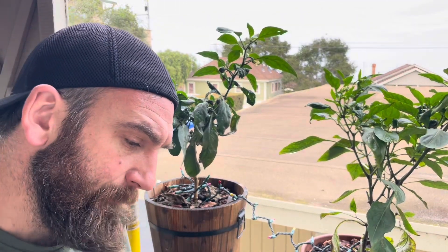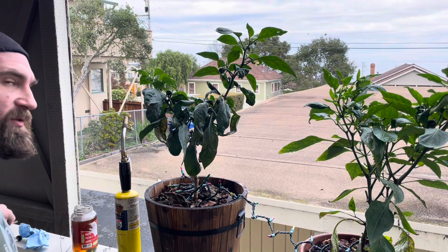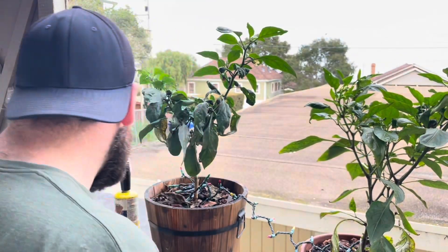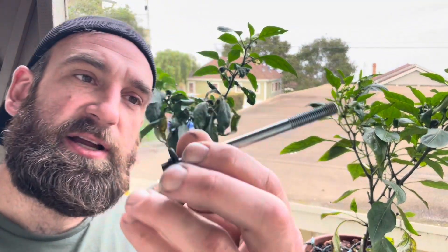Here's a little life hack. Some of these bolts for the center section to the pedestal had a little corrosion on them, and I did what I know best — a little caustic. I used muriatic acid in a glass jar, so they kind of lost their plating. See, this is how they originally looked — a nice shiny dichromate finish on them.